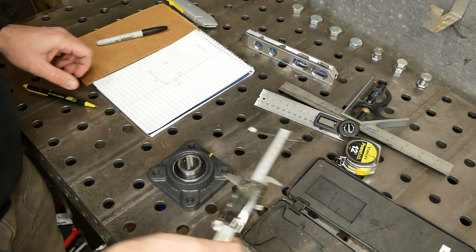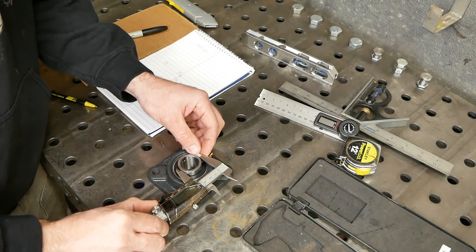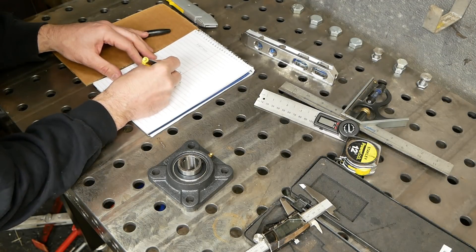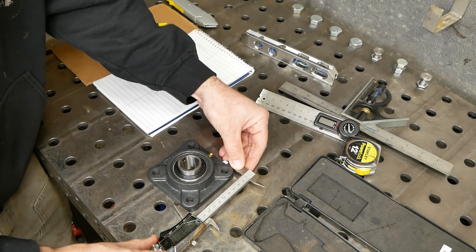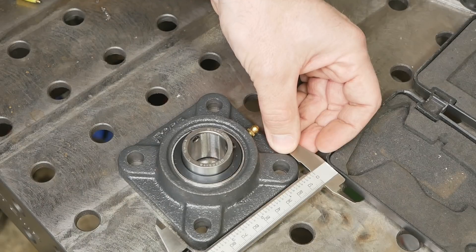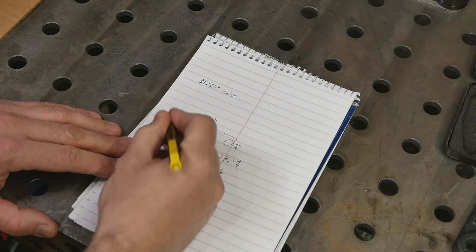Now we've got to figure out the center of this thing. It's a one-inch bore and we're going to oversize that a little bit for some clearance — let's go for an inch and three-eighths as a good center hole. One and three-eighths inch center hole. We need to figure out the outside of this flange bearing — it's three and three-quarters. But I'm going to bring it up for a real case scenario if we want to weld some plates next to it. We're going to bring it right up to four inches — that's about an eighth inch on each side. So that's going to be four inches by four inches.